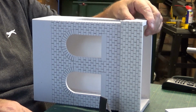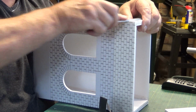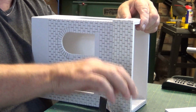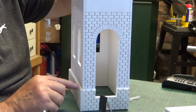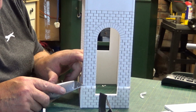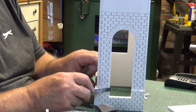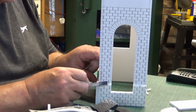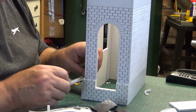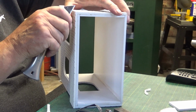So what I've done there is just literally levelled it, and then filed it in so it's running nice and flush with that edge. Because I'd cut the edge off this and tapered it down, now what I do is match that back up to that one. So I'm just going to take that corner off and file that so it gives it the same angle as that one and the same angle as that one. And this one I'll just cut the bricks back in again to this.